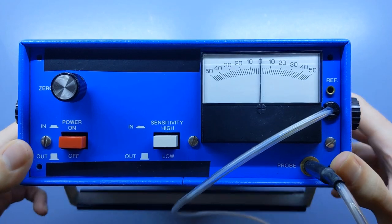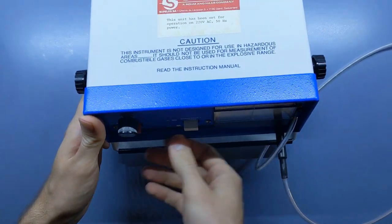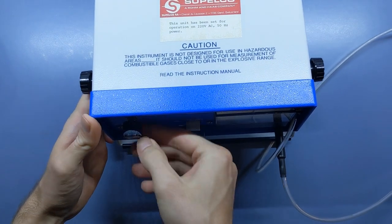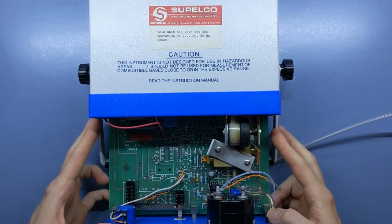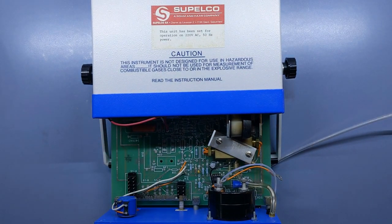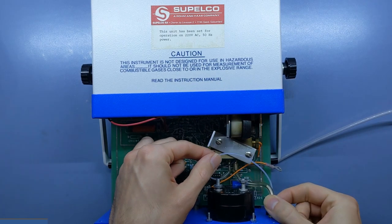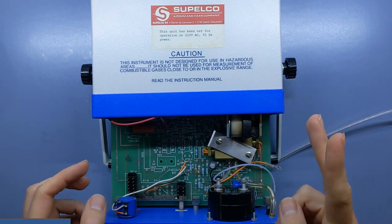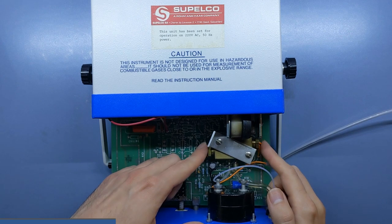Having breathed gases before, you know, I'm something of an expert myself, so let's start by how these things actually work. But to not bore you too much, I will limit myself to about 30 seconds. Ambient reference air and sample air are separately sucked in by a pump. Inside, the two streams each pass an identical heating element, which is cooled by the flow.